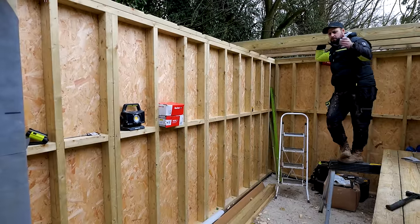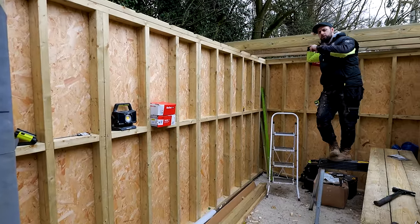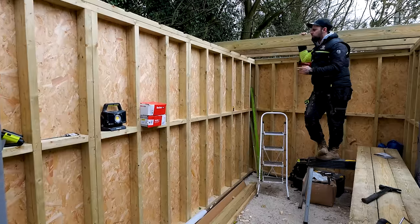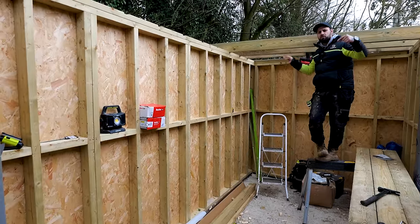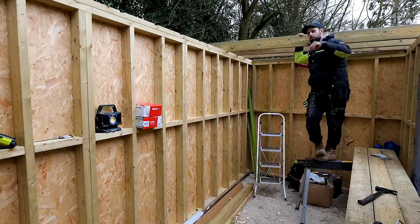Right, and because it's only me and Brad, we're going to set you down somewhere so you can see us working, and Brad's going to come and help me put this on. And so you know, we're going to be using 90mm framing nails and spiking through the sides, and then we've got some extra fastenings we'll show you later on.